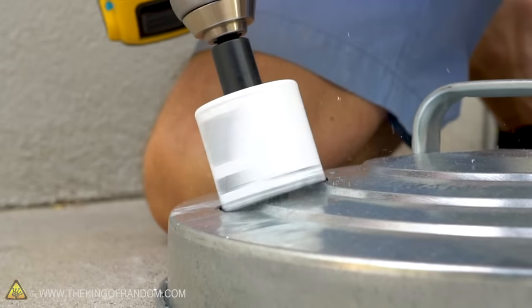This has been running for about two hours, gradually increasing the heat, and we have a nice orange glow — it looks like pretty much the entire inside right now, which is just what we're hoping for. So I think it's time — we can kill the gas and take a look at it. The radiating heat as soon as that lid came off — we've had warm foundries before, but this like it was kind of chilly and then all of a sudden the whole thing is warm. That is amazing. At this point this is finished — we have our new updated foundry. I think Grant would be proud of this one.